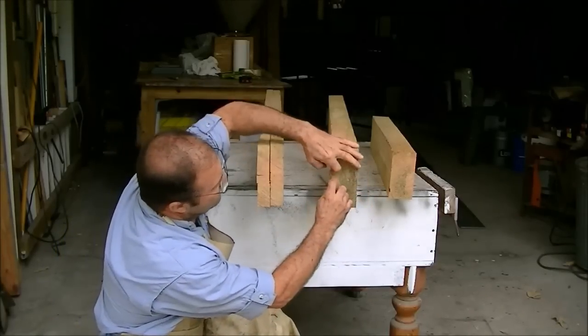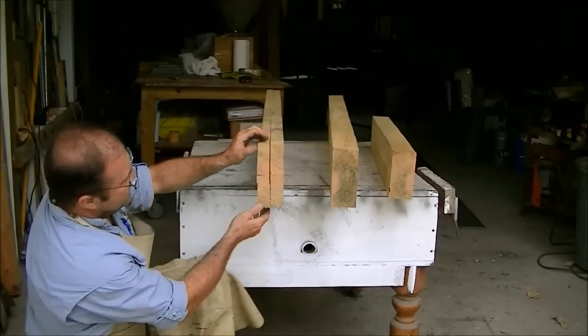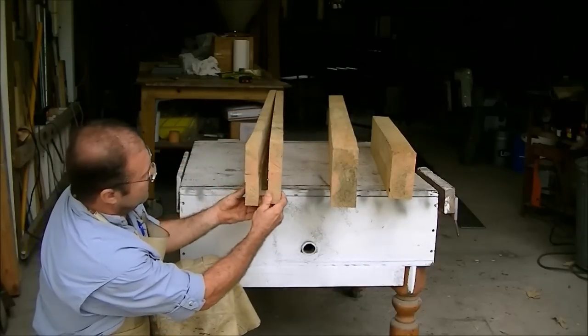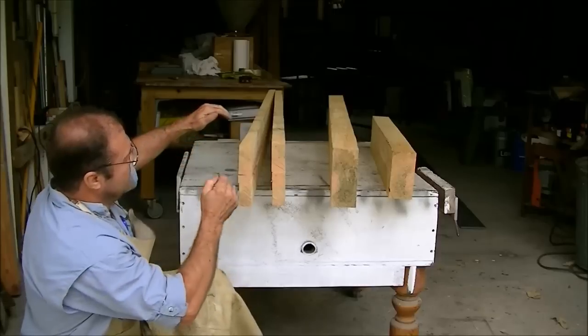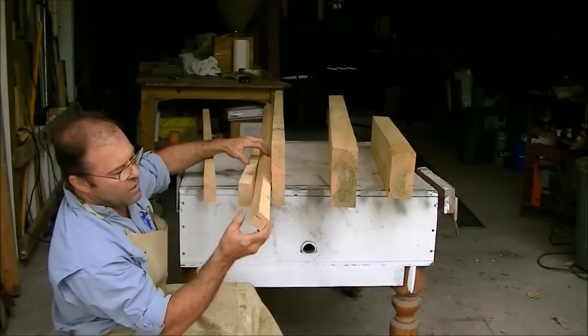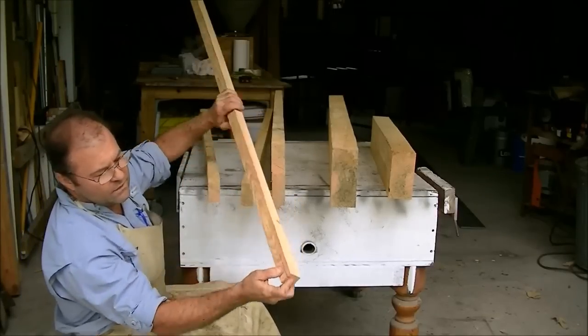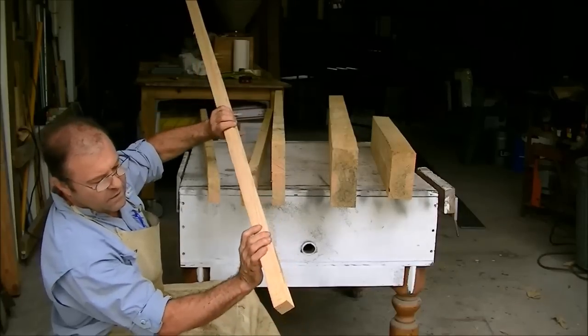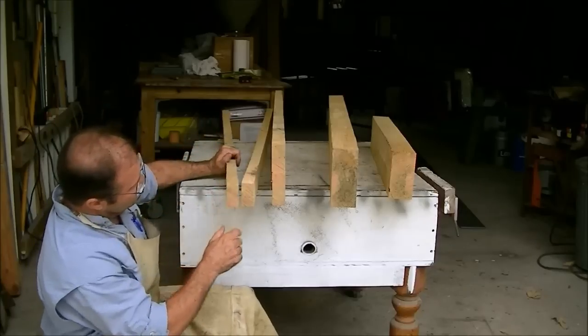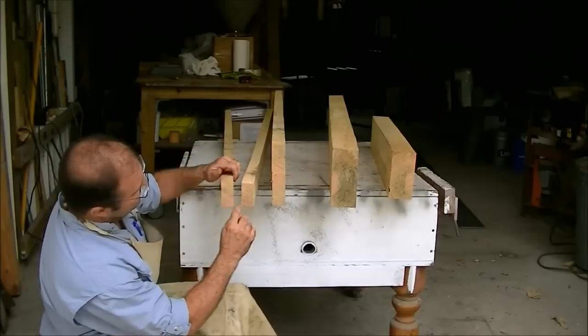and then two cuts this way. You can see how I did it here. So this was the first cut. And then we'll take a slice this way. And I want to get rid of the heart, because the heart always cracks. You can see it. It's not any good. It's called the pith. So what I'm looking for is the grain to be this way.